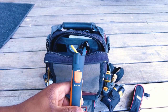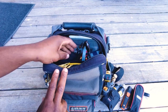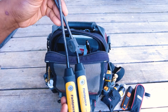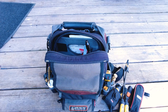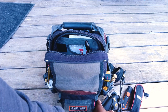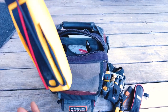This is the Testo 805i infrared thermometer — it's okay, I just keep it in there just in case. These here are probably one of my most used workhorses: the Field Piece Job Link JL3 psychrometers. I use these every day, multiple times a day without fail. Newer techs, these should be among your first tool investments. You'll also need manometers for checking static pressures and gas pressures, so pretty much the whole Field Piece Job Link kit.